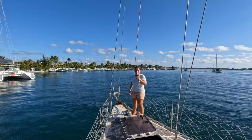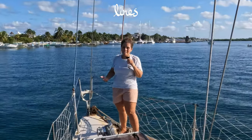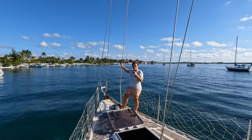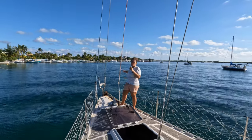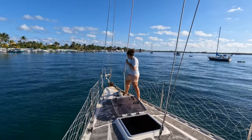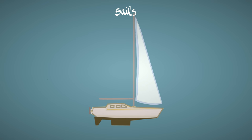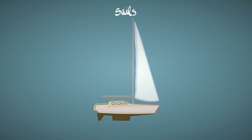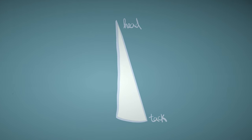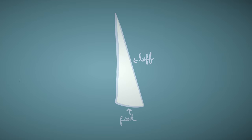Let's come to the forward of the boat. Here at the bow, we have different kinds of ropes — they're called lines. Our halyards travel up, so this halyard will bring our forward sail or jib up to the top of this stay. The shackle — the clip on the halyard — attaches to the head of the sail. We call this the jib because the sail area is fairly small and doesn't extend back past the mast. It has three vertices: the head, the tack, and the clew, and three edges: the luff, the foot, and the leech.